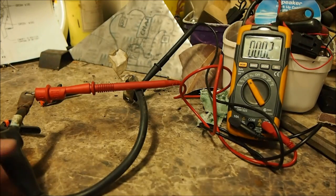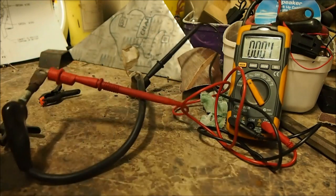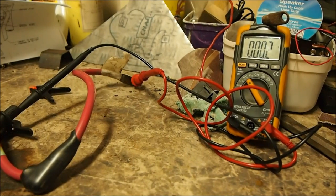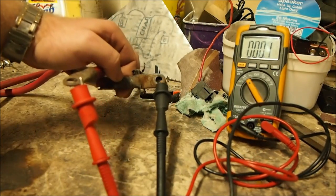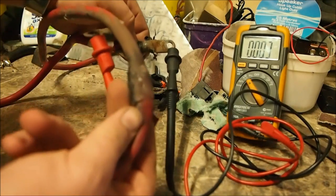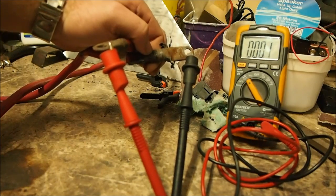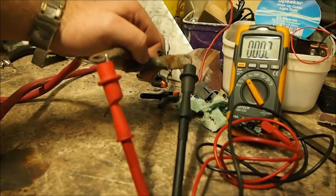What I'm doing now is just testing the resistance of these big cables. This one here is the F2 cable — it goes to the F2 terminal on the actual motor itself. As we see, its resistance is very low, so we know this wire is good. Now we have the F1 cable, and it's good. And here we have the big main power cable coming from the battery itself — it's got very, very little resistance. Moving them around a bit, we know all these wires are pretty good. There might be a join on this somewhere, but moving it around isn't doing much, so we know this cable is still good and we can still use them.